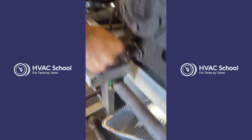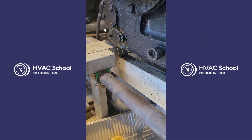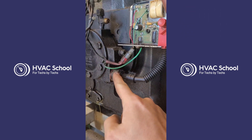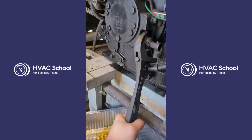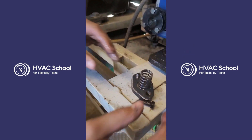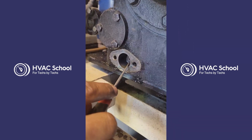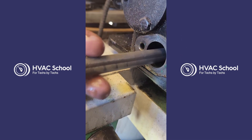Now that we've got the compressor pumped down, two half-inch bolts hold the cover plate for the oil pickup screen, which we will pull and clean, and drain any excess oil that is in the bottom of the compressor, as well as clean the Centronic sensor itself. With a big boy wrench we crack that nut, and using a pick, gently pulling out the oil pickup screen — which is surprisingly clean. That is a good sign.